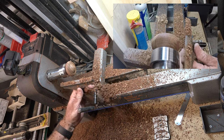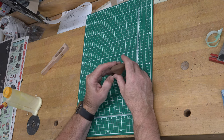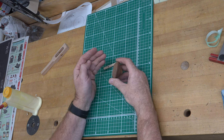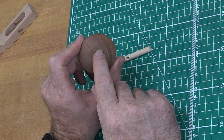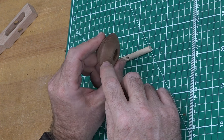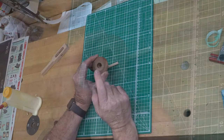Once you're happy with the shape of your top, give it a good sanding — and there we have our top body. I didn't exactly follow my pattern, but I came close, and that's all that matters. Here's a case in point for wearing your face shield: look at that crack right there. I didn't see it when I first put this on the lathe. It turned out okay — it didn't blow apart — but the chisel could have grabbed that crack and it could have just exploded, sending pieces right at you. Get your face shield on while you're turning; you never know what's inside.